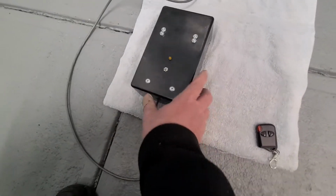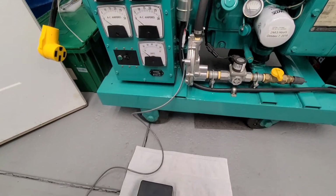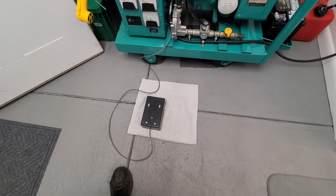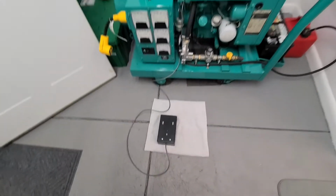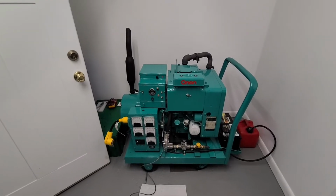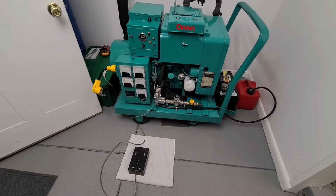Basically, the way it works, okay, you leave it hooked up to your JB, which goes into your control box. I'll show some pictures in this video right here. It basically just goes to your terminal strip where you got your B plus 1, 2, 3, and 4. Very simple wiring. Again, I'll get into that later on with some photos. And you could just leave this thing attached to your JB. Actually, this will work for a lot of 3-wire start Onans. So I'm just using the JB, being I have this here, and Leon has his at his house.